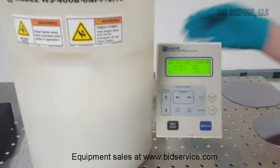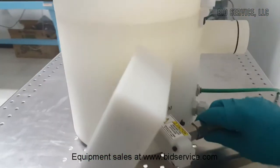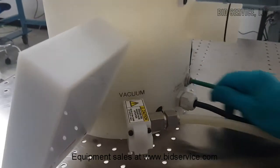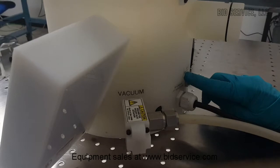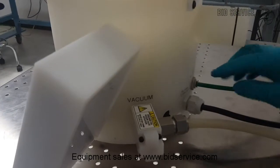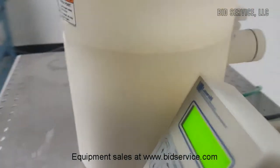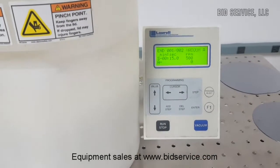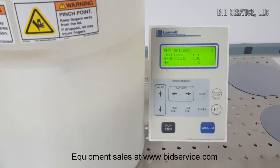The unit requires connections for both vacuum and for a purge. Typically, this purge can be nitrogen, and it should be between 60 to 70 PSI. If it is below 60 PSI, it will give you a warning on the control panel letting you know that you do not have sufficient purge. The same with the vacuum — if the vacuum is too low, it will also alert you. Typically, the vacuum needed is from a vacuum diaphragm pump, and a pump that achieves between 20 and 25 inches of mercury is sufficient.